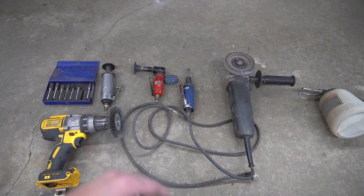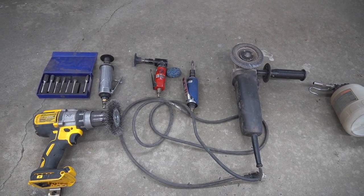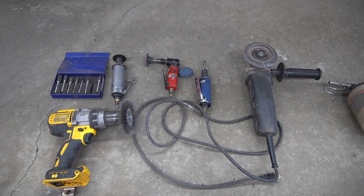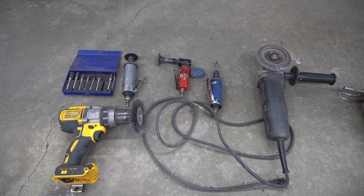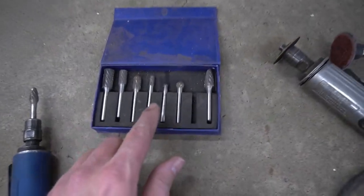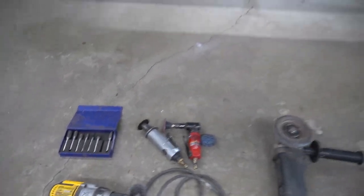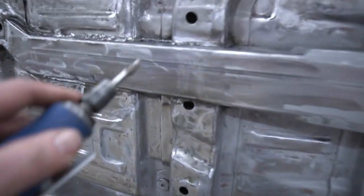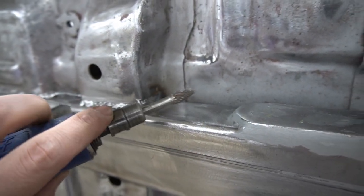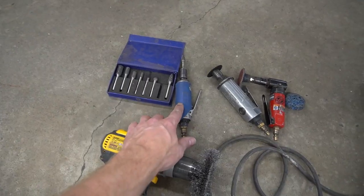You'll notice I got everything out of the corners and all the little pieces as well. Starting from left to right up here, we have a cutoff wheel — I use that a lot to grind down welds. This goes together here — this is a double cut burr, and these are all the different kinds you can use. What I use that for is getting in tight corners. Whenever I got welds in a tight corner that I can't get to with the cutoff wheel, I come in with this double cut burr, find the right shape and size, get in there and clean it up. This works really good.